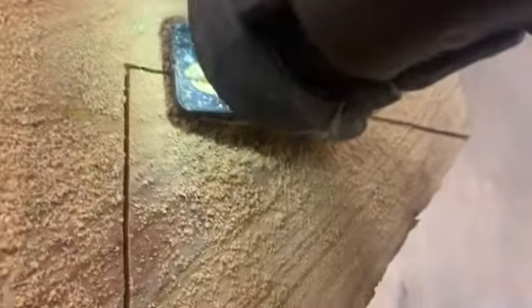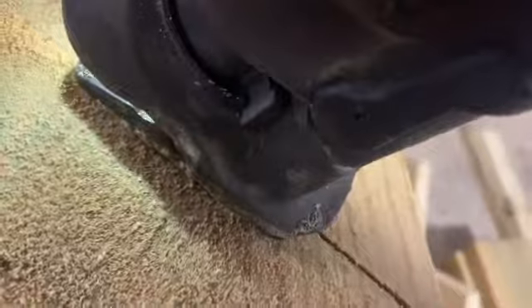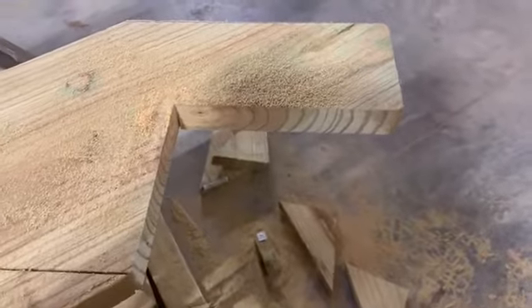I can't cut it all the way out with a circular saw trying to make a square cut in the corner, so I'll use the reciprocating saw. I've got all those cuts done, and cutting up to the corner on both sides - it falls out and you have a square cut. That's the tip there.